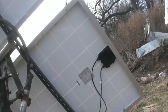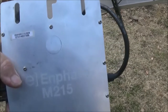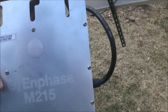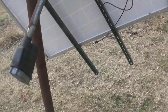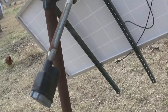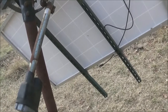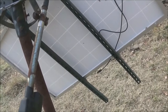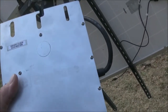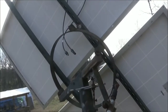You have to have one of these microinverters for each panel. I think I paid $150 each — every company has different prices. If you go and buy a good quality grid-tie inverter, just say 2500 watt, it's going to cost you five, six, seven, eight hundred dollars, and you can hook up to 2500 watts to it — but that's your limit. If that grid-tie inverter burns up or blows out, your whole complete system is down. The thing with these microinverters is you've got one on each panel and they're all tied together, but if one goes out the others keep working. So you only lose the power coming from one panel, not all the panels.